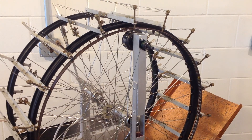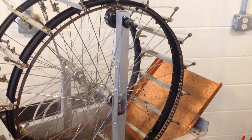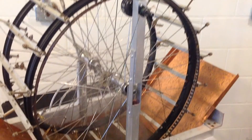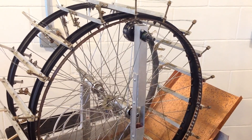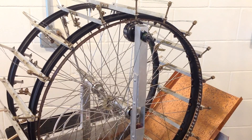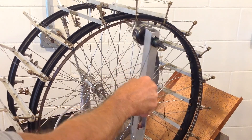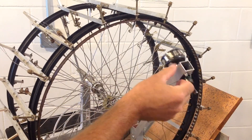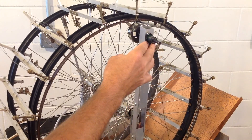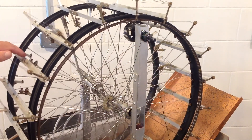In order to get some more useful power out of it, I built in some magnetic gearing. What I have is a flat ring of steel with magnets spaced around the inside of it, and this makes the big magnetic gear. The smaller magnetic gear is simply a hole saw bit with magnets spaced around it to match the bigger gear. It's just mounted to a support with some bearings, and it can also swivel out of the way when I want to disengage it.